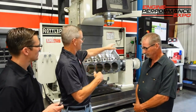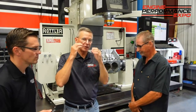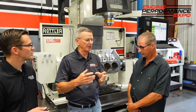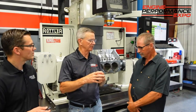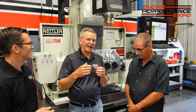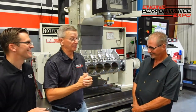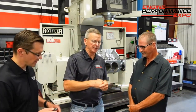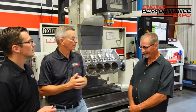We've talked a lot about surfacing and boring, but we also make equipment for porting aluminum cylinder heads and making parts from billet. Is there any basic rule of thumb or trusted internet resources for customers who maybe aren't as well connected to research some of that stuff? All of the major industry insert builders have websites — go there. They put a lot of good information on their sites about applications. We make what we call lollipop cutters — a round ball cutter — for aluminum, cast iron, and CG compacted graphite. Form milling is getting very popular and everybody's getting unique with it.